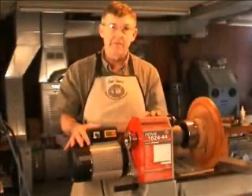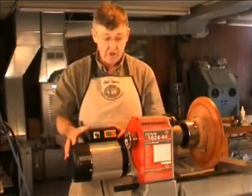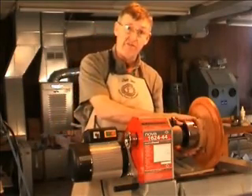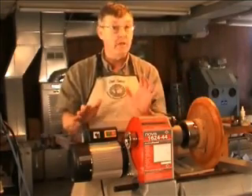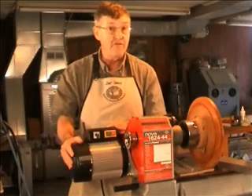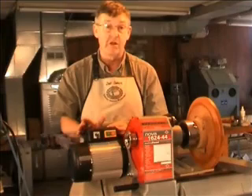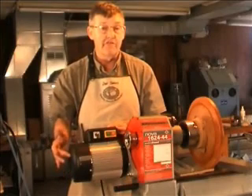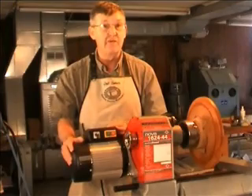One final point about this excellent headstock design is the motor. First, it's placed in a thoughtful way so that it counterbalances the load placed on the headstock by the weight of the chuck and the work. You tend to have a balanced load, so especially when you swivel the head you have the least vibration. It's also a very powerful motor — 1.5 horsepower — and it has a reverse feature, which is hardly ever found on an entry-level lathe. Finally, the fan on the motor is positioned such that it tends to suck in the least amount of dust and run it through your motor.